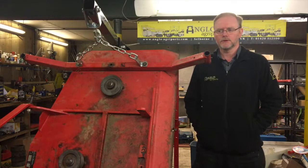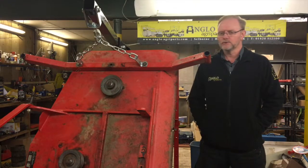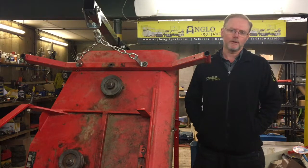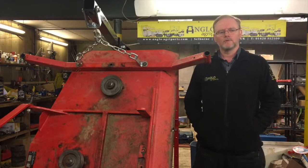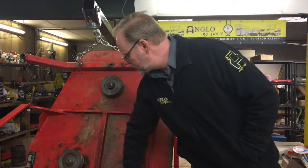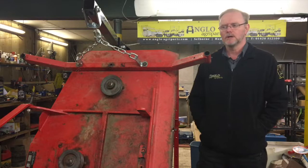I haven't filmed the whole thing. I figured you guys have probably seen enough of me stripping down mowers and putting them back together again. But for this video, I thought I'd give you a few highlights, a few little bits and pieces, as I start putting it back together. As you can see, I've already stripped it, cleaned up all the parts and replaced the bearings in the hubs. So those are now spinning nice and freely. They were quite gritty to start with.